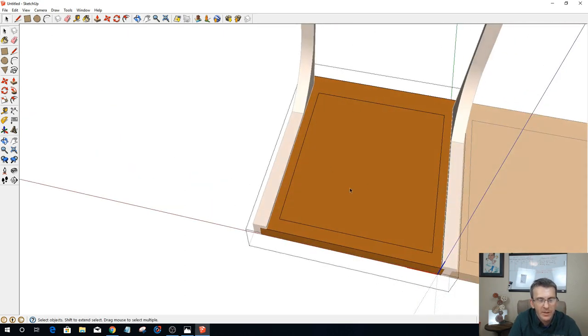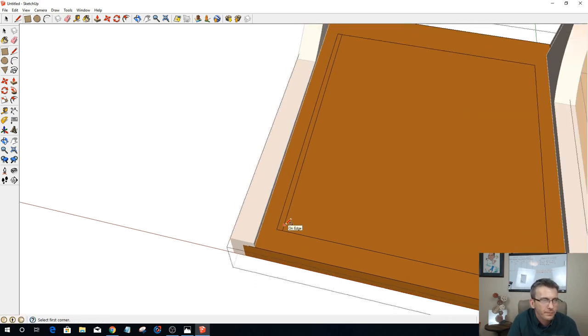And now the grids are going to be in between there. And so what I would like to do is draw a rectangle. And I want this rectangle to be about the width of the slot that I'd like. I believe my plate rim is around 1/8 inch thick. So to let it sit down in there, I think I'm going to go with probably about 3/16. So it's going to be 9.75, 0.1875, enter. Okay. That's going to be that.